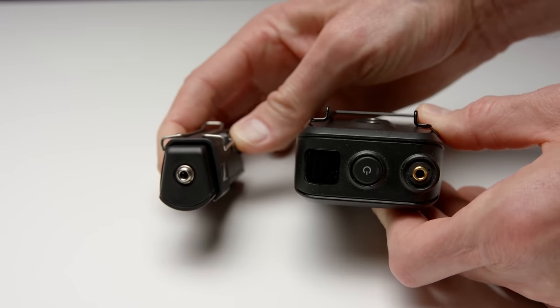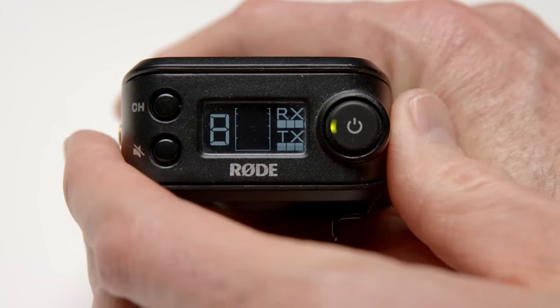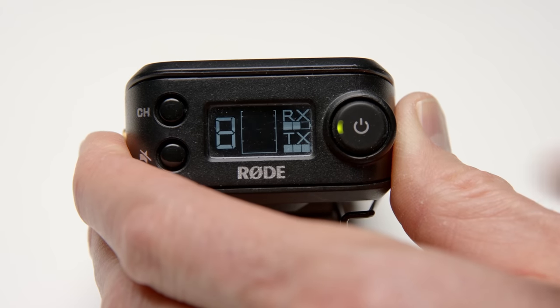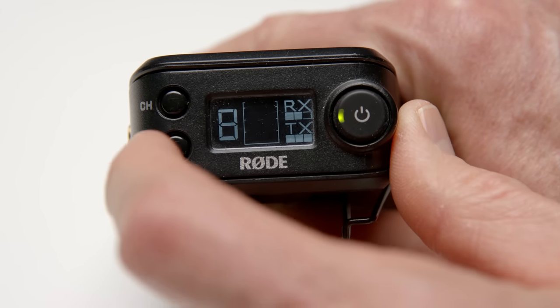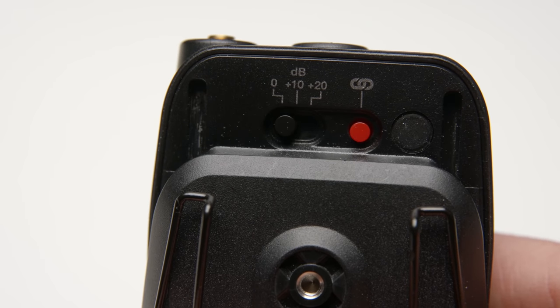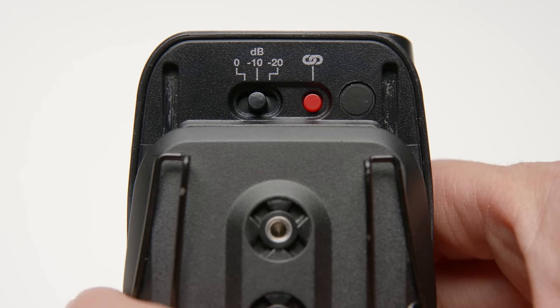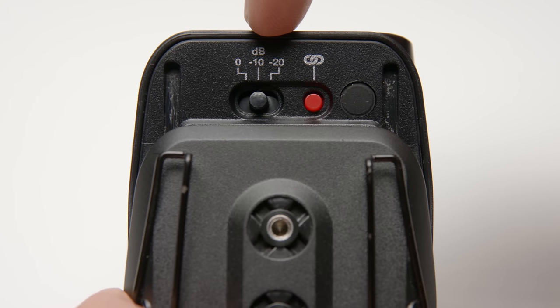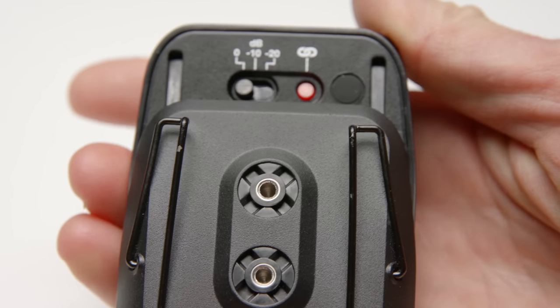If you want something that's small and that's a very high priority for you, I think the XSWD is probably a good choice if you're willing to give up a few things. The nice thing about the Rode, for example, is it has OLED readout screens where you can actually see the battery status, which channel you're attached to, and whether or not you're muted. The XSWD accomplishes the same thing with a blinking LED light, so you have to memorize those colors — but that can be a worthy trade-off if size is more important to you. One other advantage the Rode has is the ability to adjust the input level on the transmitter and the output level on the receiver. So if you're working with a Panasonic GH series camera and recording things where people may be laughing or yelling a lot, it may make sense to have that extra control, and that's where the Rode Link may be a better choice.